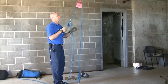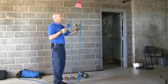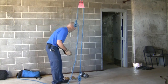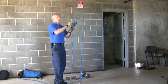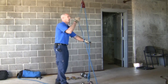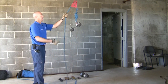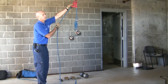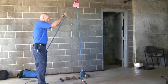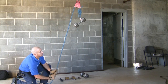All I did is change the direction of the rope — like the old wells with the water bucket that goes down and they pull it back up. The only advantage this is doing for me is instead of reaching over and pulling up, now I can pull down. But I have no mechanical advantage because this is a stationary pulley — it's not moving. I pull six feet of rope, it moves six feet. One to one.